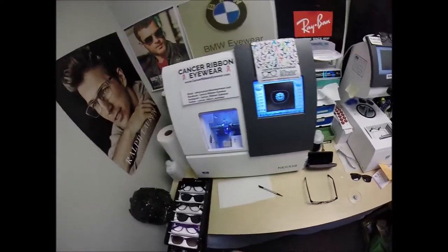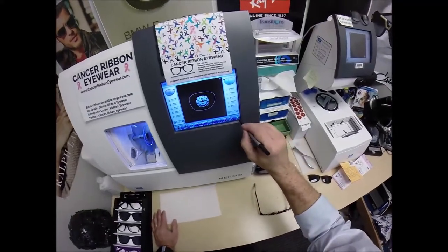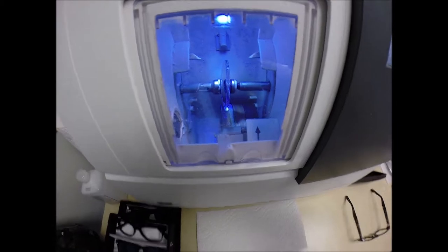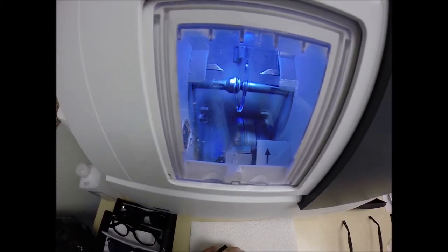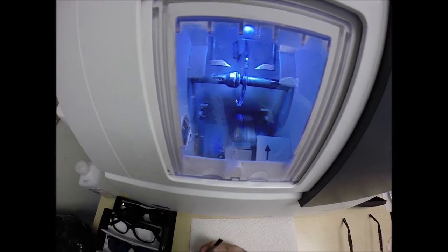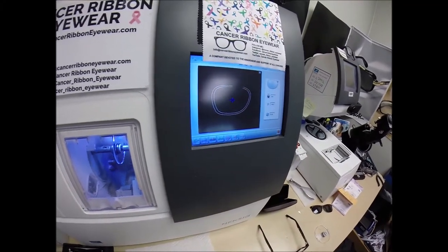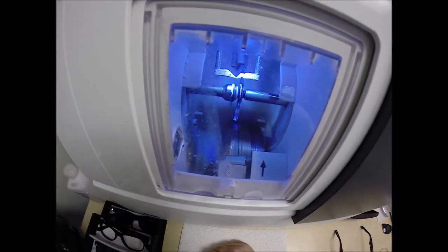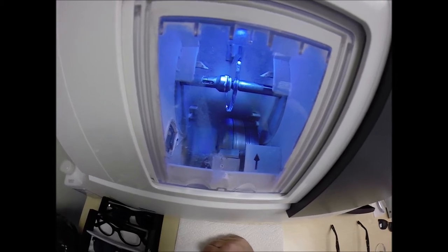Free bad jokes with the making of every pair of glasses! We're going to hit the green start button. The door closes, the clamp shuts, and the lens will be traced by two wide styluses, making sure the lens is large enough to fit into the frame on the first go-round. Then, like the old carpenter saying — measure twice, cut once — it measures the thickness of the lens at every point to know where to place the bevel so you have the least amount of edge thickness showing.